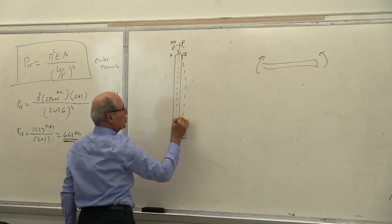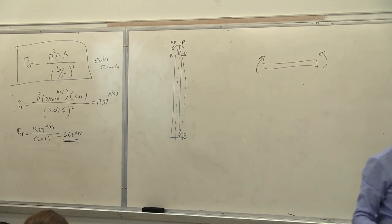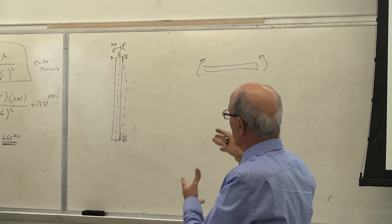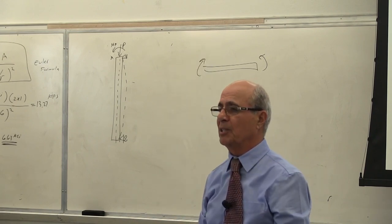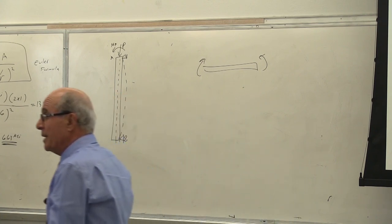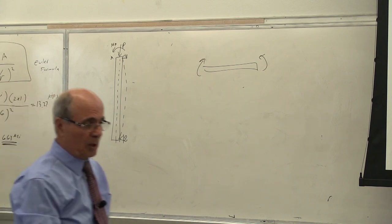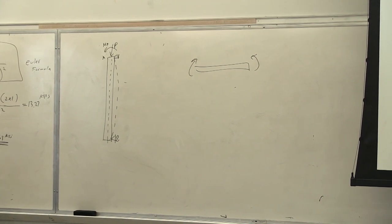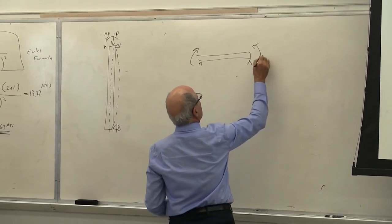This beam is going to go through some very slight bending, like what you see in a beam, which you can calculate. But since in this position there is also an axial load, it may go through buckling. Everybody understand well that already there is a bending there. So I have to somehow incorporate the bending and the buckling together. This is two phenomena, and bending is something you can calculate from the past. You have had a beam like that, sitting on a support like that. This is M and then M.